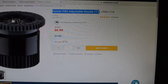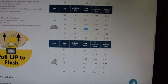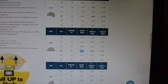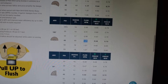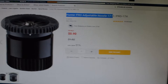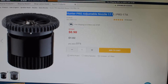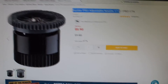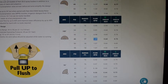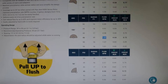The Pro Sprays put down half an inch in the section we're replacing in about 12 minutes. When I bumped up to the Rain Birds, it took 40 minutes for that half inch. The reason we're doing that is because we have heavy clay soil and we're in a Western state. After 12 or 15 minutes of those heavy Pro Sprays, it just runs off. There's some slope to the yard, so it runs off into the gutter — that's your water going down the drain. During the growing season you always see water flowing in the gutters and it's not rain, it's runoff. The whole idea behind lower flow is to give that clay soil time to soak up the water. It'll hold water really well, but it has to have time to do it — if it gets water too fast, it just runs off.